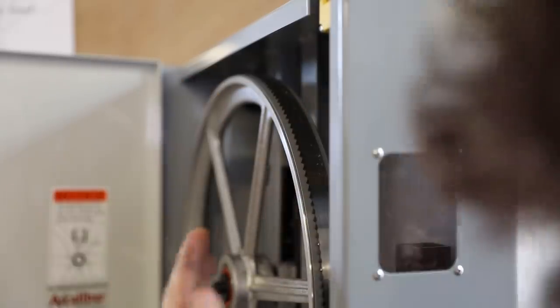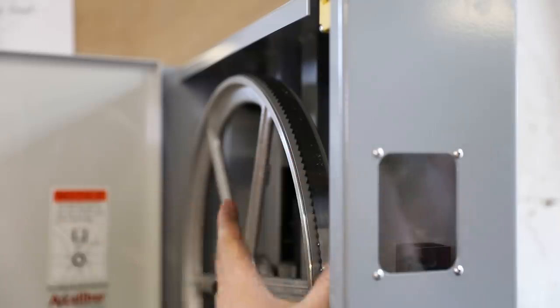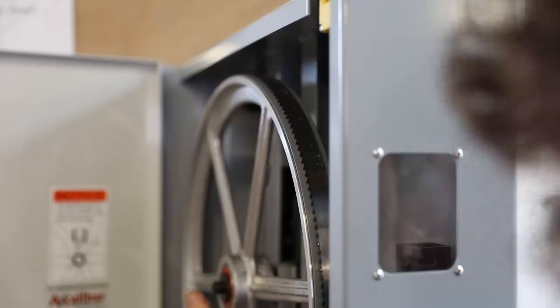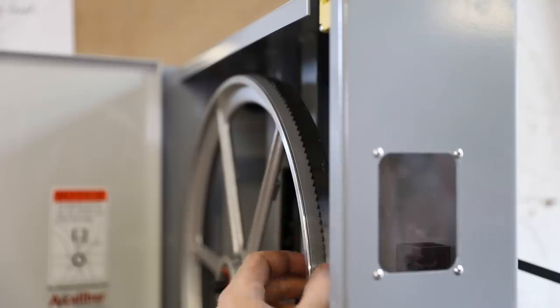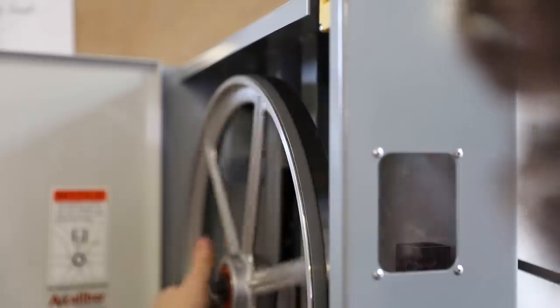It's something to do with the arc of the wheel, because if you put that blade central on the wheel and it's on the sort of arc, then it's going to wobble side to side. Whereas if you center it more towards the back, the teeth therefore have more tension applied to them. So you're actually going to get a straighter cut because those are now properly resting on the tires. So I don't know. The guy definitely knew what he was talking about.